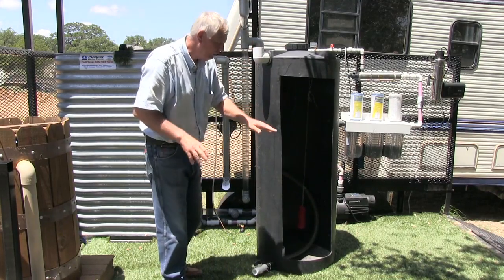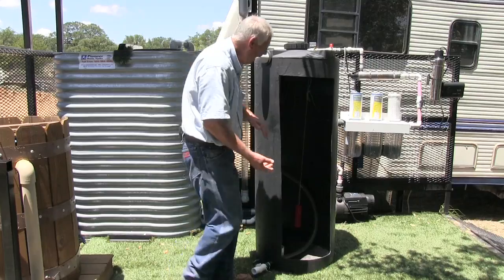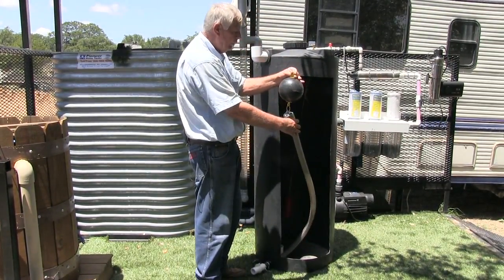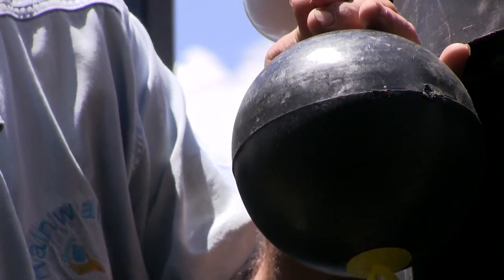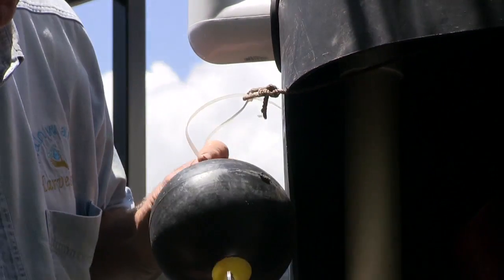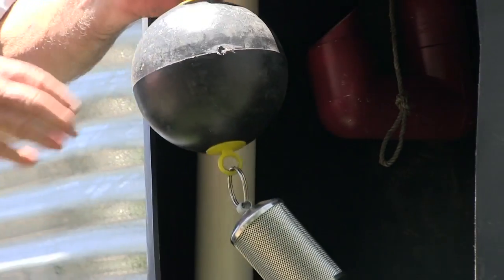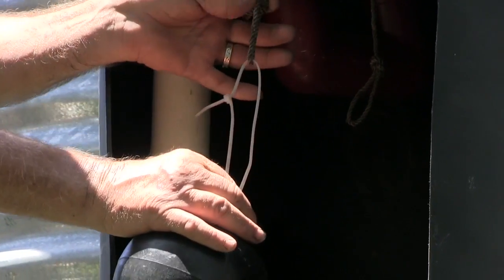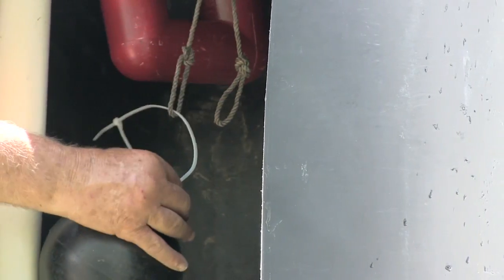The highest quality water inside a tank is going to be closer to the surface. So I have what's called a floating intake, with a float on it so it stays at the top of the surface, connected out to where it goes to my pump or supply. A screen lets water through to the pump, and it's tethered so it won't go all the way to the bottom — it goes up and down to take water closer to the surface.